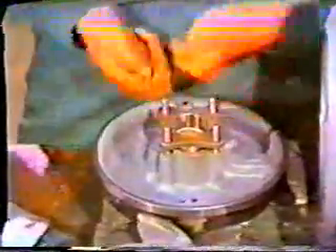With the tagging completed, the workman removes the gland nuts from the gland studs. Then the packing gland follower is removed. All the parts are bagged for safekeeping. Next, he's ready to remove the packing and seal cage. Since this is a new pump, the packing hasn't been compressed and the workman is able to pull it out by hand. If the packing were old and compressed, the end plate could be turned over and the packing pushed out. The pump is now fully disassembled.